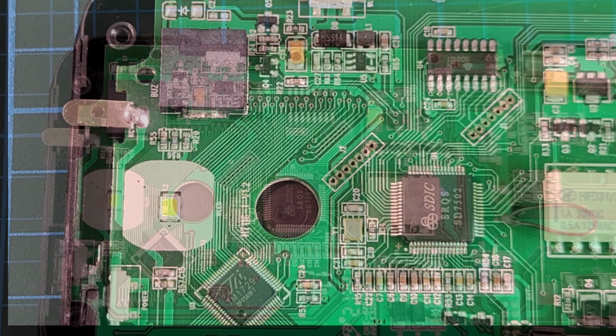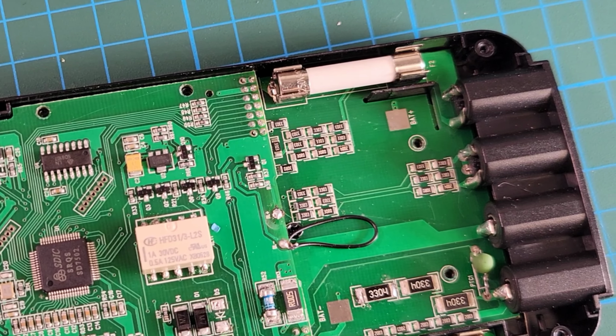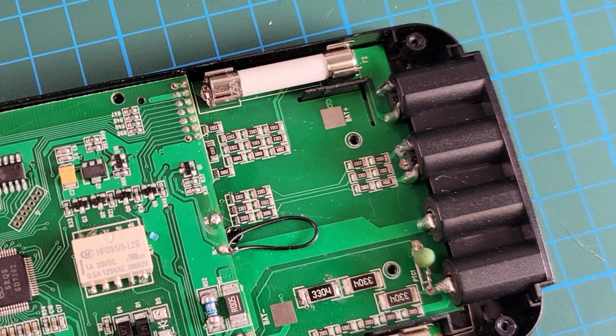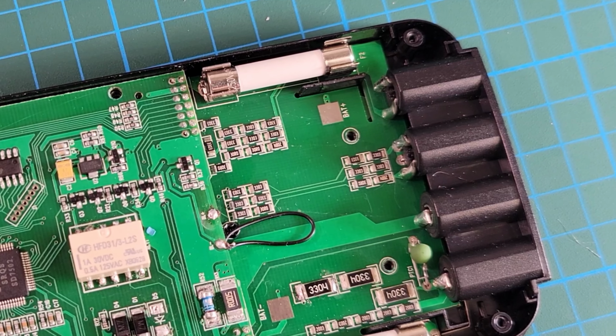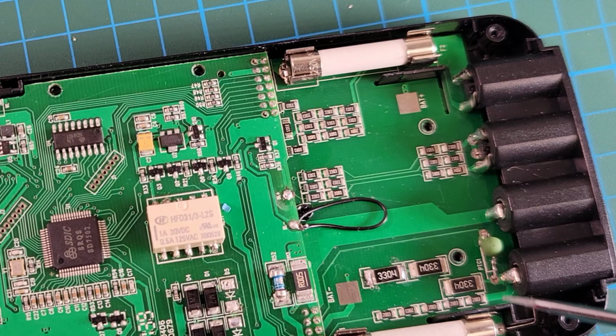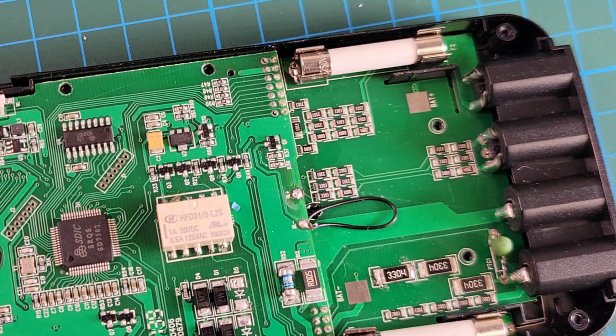Generally speaking, though, I mean, look at it. That is a pretty clean, pretty sweet-looking PCB here. Very, very nice. No flux, no crap, no weirdness going on, per se. I did neglect that one little PTC at the bottom over here. So that is on the voltage side as well. One PTC. I don't see any MOVs whatsoever.